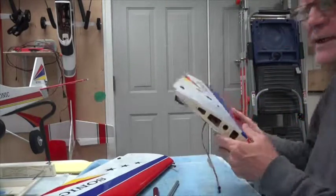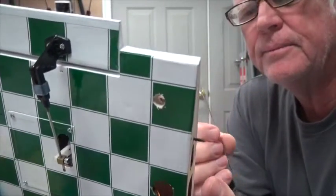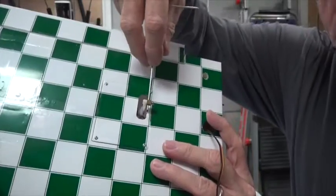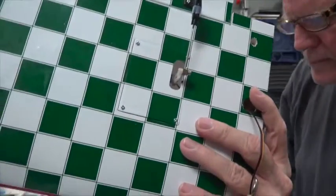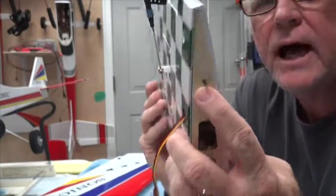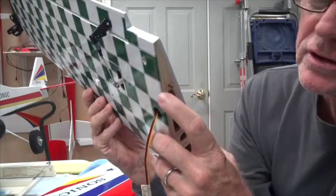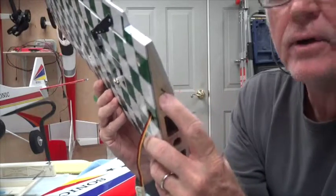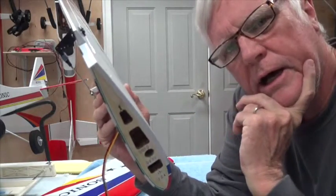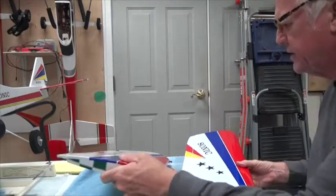So what I did — you can see right here — I took a piece of metal rod that was cut off from the aileron, because this was a longer piece. I inserted it on one side, measuring five millimeters from the back end of the hole, then measured equidistant across, and put a metal rod in there. That metal rod is about five-eighths of an inch long. I measured the same spot on the other side and drilled the hole for it.